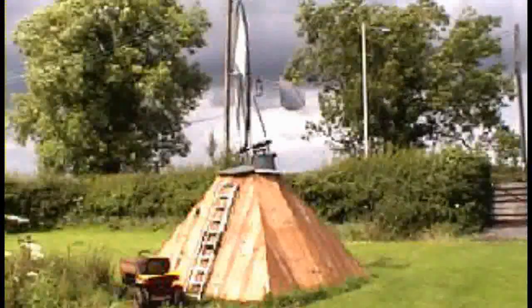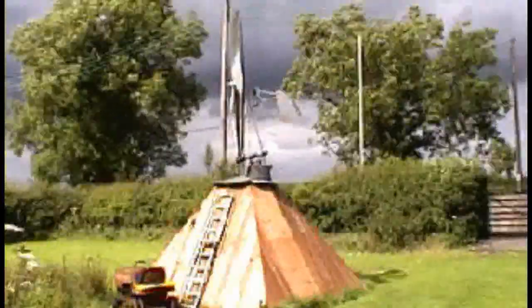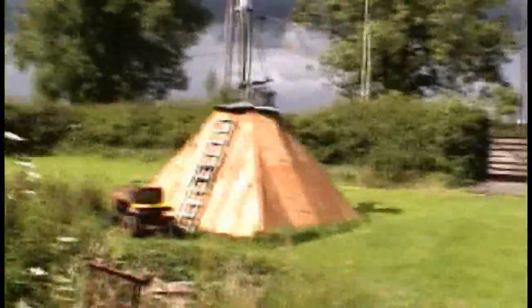After many changes to the turbine and generator — by changing the outer ring from square hollow section to three-quarters square solid bar, adding a flywheel to the generator, and using a solid rubber friction drive on the generator — I had a working turbine.